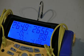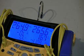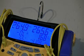So you start off with your temperatures on the top, and then below that, depending on what you're trying to do, you've got your superheat and subcooling. And below that, to the bottom left, I'm sorry, to your left, is superheat, and you've got your target superheat if you're calculating. Then to the right, you've got your types of refrigerant. Scrolling through the refrigerant list is pretty easy. Of course, naturally, we only deal with R410 and R22 right now.